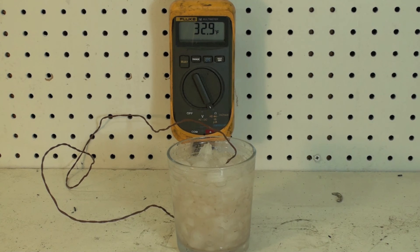Make sure it's accurate. By the way, if you've got a Fluke 116 — that is the Fluke 116, they don't make that anymore — there's a good chance that your temperature probe will be 10 degrees or more out. Fluke has not fixed this for at least 4 or 5 years that I've been dealing with them. The meter's pretty good other than that, but definitely if you have a Fluke 116, you better check that. And that's not the probe — if you change the probe, it won't make any difference. That is the temperature probe and how to calibrate it on the multimeter.